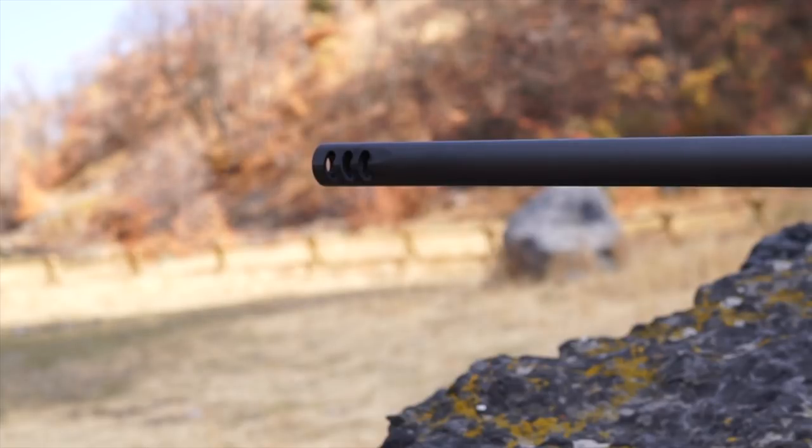Let's start with the business end of the rifle. Right out on the very front you can see the side discharge muzzle brake. This is made from stainless steel and it's very effective at reducing recoil as well as muzzle jump. It's threaded on with 5/8x24 threads. If you ever need to take it off you can, but it does look seamless — it looks as if it's been machined right into the existing barrel. They've done a very good job with the machine work there.